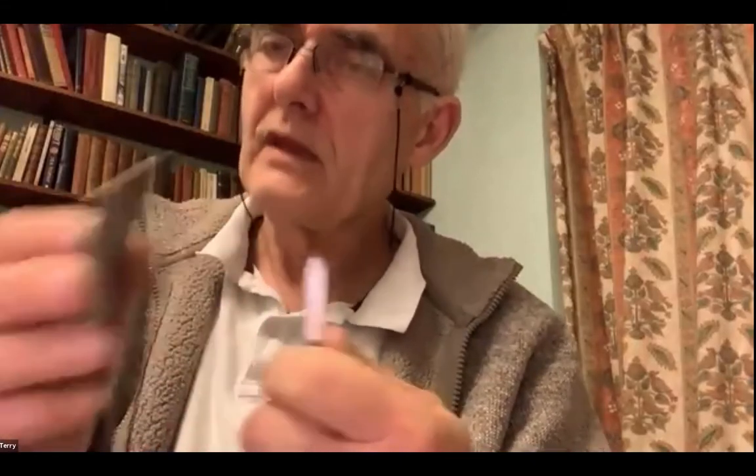put a new one on from the bottom. And you can do that 2 or 3 times, but each time you're losing metal from the cutting edge, making the cutting edge itself blunter because you're converting it into a hook. And so you have to press a little harder each time. And after a while, it just gets difficult and you go back to the grinder and start again. So 3 times and then repeat the cycle.